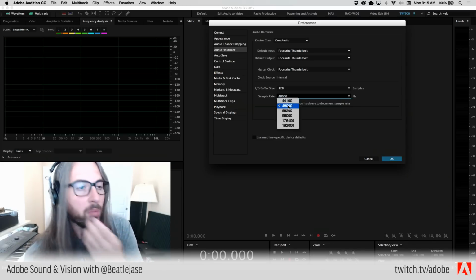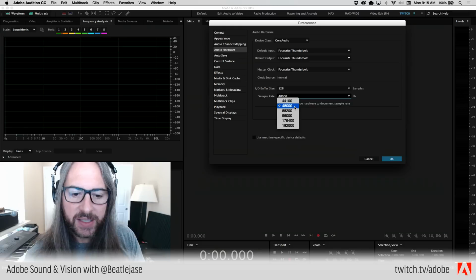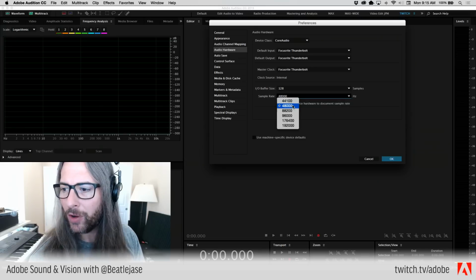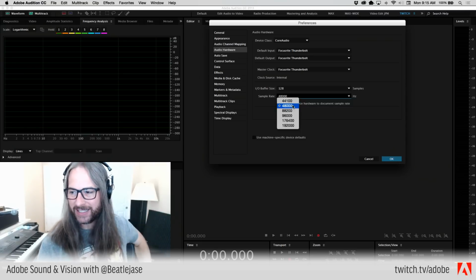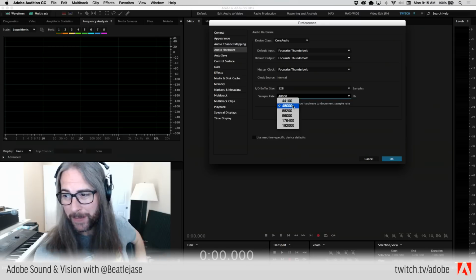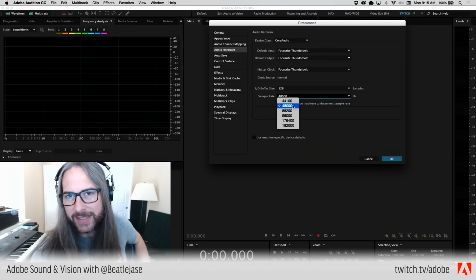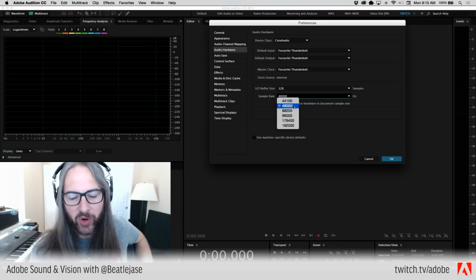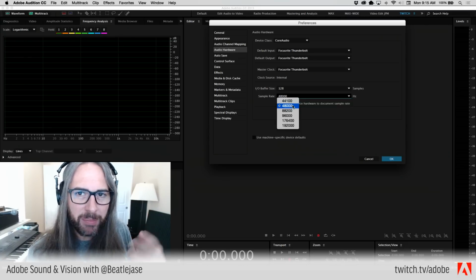There is definitely more high-end presence, and definitely more air and space in the sound at 48K. This is something that you will actually perceive, even if you're older, like me. Your ability to hear high frequencies tends to roll off as you get older, unless you have super ears. 48K sounds better. As a general rule, I like to record at 48K 32-bit. That isn't ultimately how I deliver files, but it's just a better overall sound.